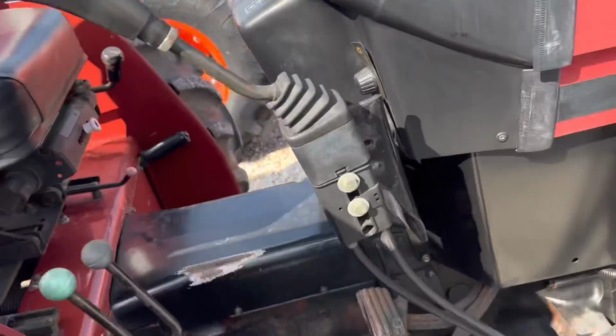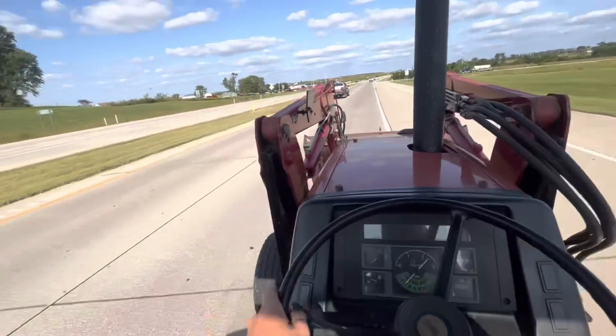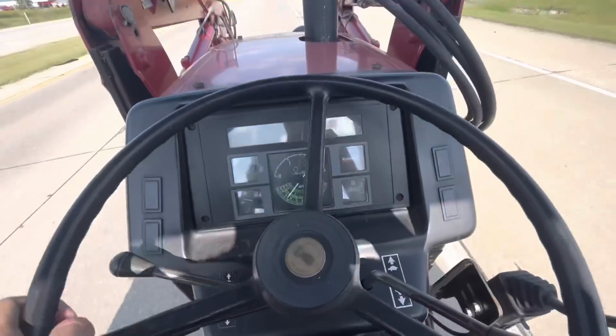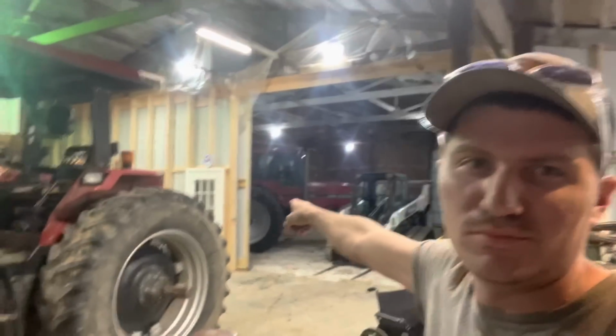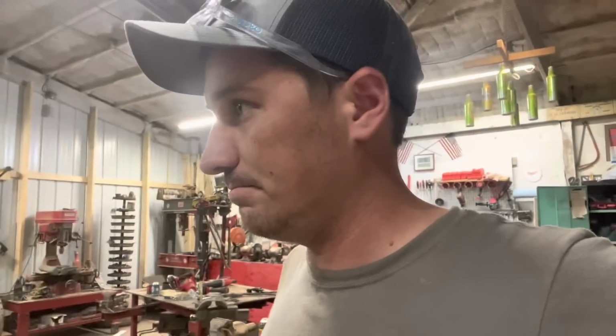It'll be there. Well, out with the old, in with the new. Gotta go get the key, but she's ready. Oil, fuel, hydraulic filters changed. That's done. Tire pressure's good on everything. All I've got left to do is grease the front ends of both tractors.